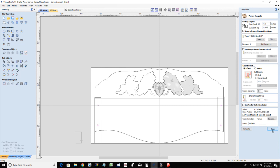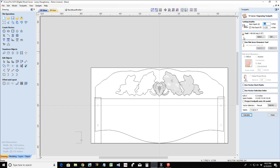Oh, let's not do a pocket cut. Let's do a V cut. V carve. Don't need a flat depth on it. 60-degree V bit. I want to start at that quarter of an inch down, because I just pocketed that out, right? So I want to start at a quarter of an inch down, and I want to calculate this,